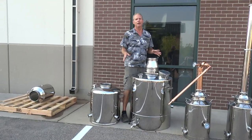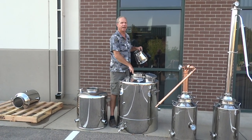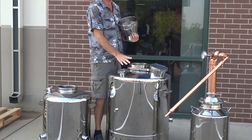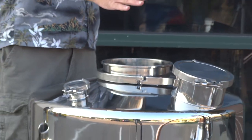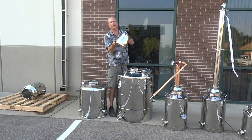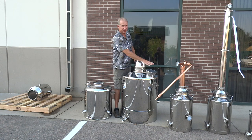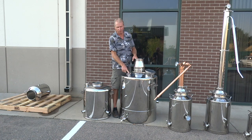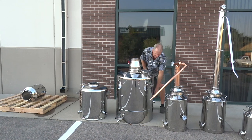This is our new 53-gallon can. We've had the same can for a while, but we changed the top — now it has an 8-inch tri-clamp barrel on top. If you order a can, you have to get a reducer now. This made it a lot more rigid and sturdy for our bigger towers — we've got four 6-inch and 8-inch flute towers now. If you buy a can, you'll need to buy a reducer too. It adds cost but made it a much nicer can. It comes with a 6-inch clean-out, a 2-inch fill port, a drain, a half-inch MPT, and two ports for your heating elements.